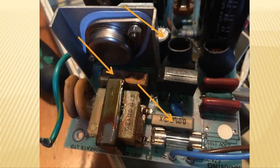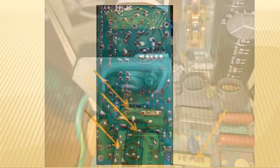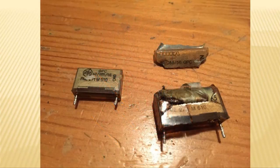Here's a closer look at the three components, and another view with a bit more light. You can see the one on the left has actually burst, and you can see cracks in the casing. If you turn the board over, there are three areas that you have to de-solder, and there are two pins on each. These are the bits that you literally have to heat up with your soldering iron and gently rotate the component until it slides out. And finally, here are the two components that I replaced — one was completely blown, and the other had hairline cracks so it wouldn't have lasted much longer.